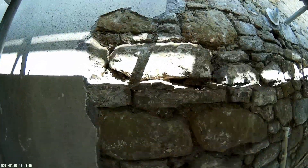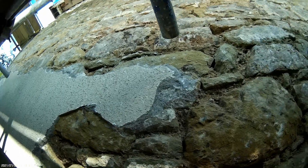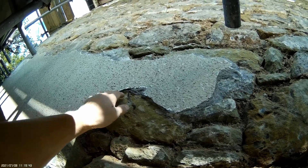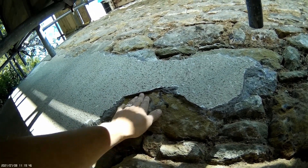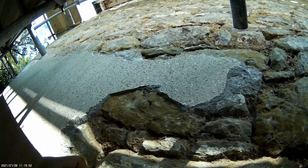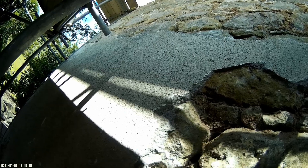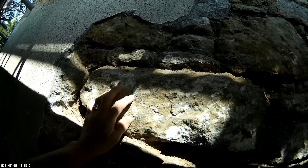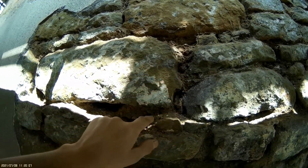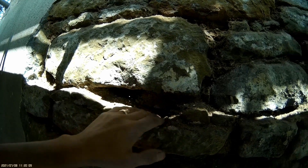Right, let me show you what I've got around here — as you can see, there's a lot to do. Hopefully I'm not too quick with the camera. You can also see just how difficult it is to get off some of these stones. The art is to get a flat bit like that and get your chisel right in, give it some welly — a double whack is a good one where you're hitting it hard and let the hammer bounce on it. It's almost like the second bounce helps it. Sometimes giving them a whack just to hopefully crack them, but I don't want to damage the stones because these are old — this is really, really old, 140-something years old — so it's going to take some cleaning out.